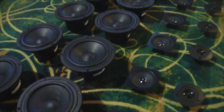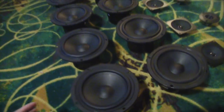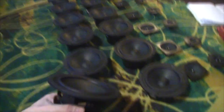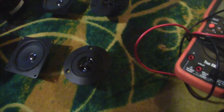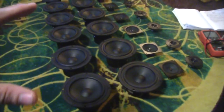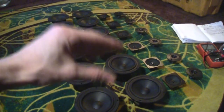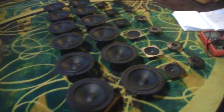It's really, really interesting stuff. I'm doing research all the time. But the confusing part is that on the website it says these can perform really well in an enclosure all by itself at 0.75 cubic feet — so three-quarters of a cube for just one of these. That's a lot. These guys are around 30 watts each, so I'm going to be wiring these in series and then bringing them together, which comes out to about 8 ohms.